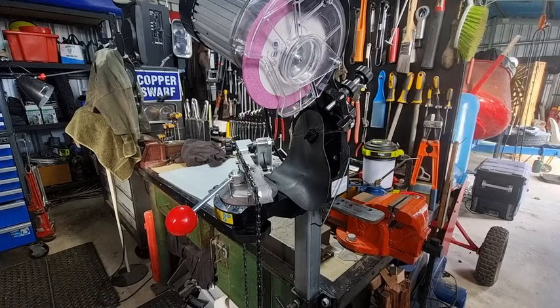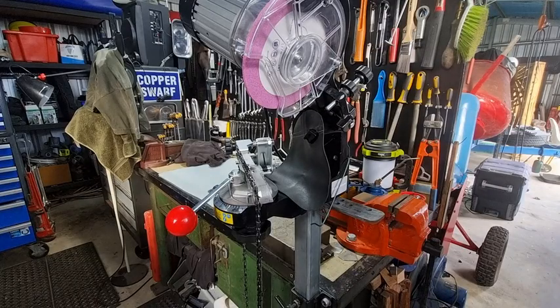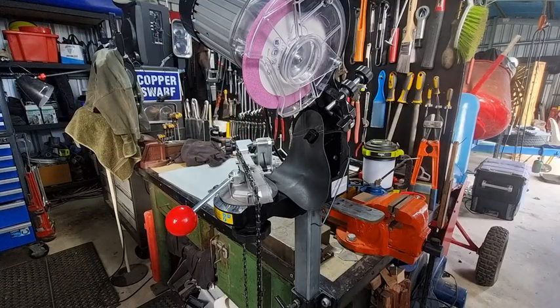What they normally tell you to do is to keep them all the same length — this is the ideal situation. But it's not the most practical, because no matter how good a chainsaw grinder is, you'll always find a discrepancy of even up to a millimetre sometimes. A brand new chain out of the box, it's quite normal to get a half a millimetre difference between the longest and the shortest on the left side and the right side. So it'll never be much better than about half a millimetre.